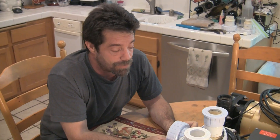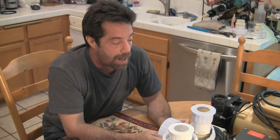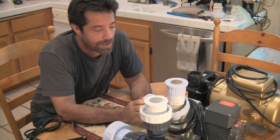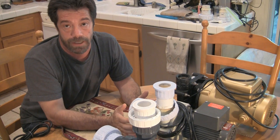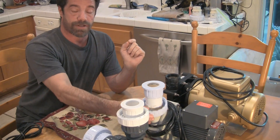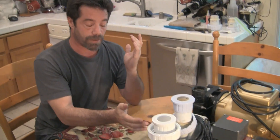I expect a good drop in summertime ambient temperatures with the DC pump. I'm a little concerned that in the wintertime I may actually have to substitute in a Dart for my closed loop. Fortunately, with the way my plumbing is, I can swap out a pump in about two to three minutes — just close two valves, disconnect two unions, pull out the pump, put in the other, close the unions, open two valves, plug it in, and you're done.